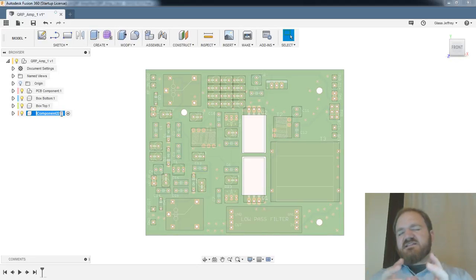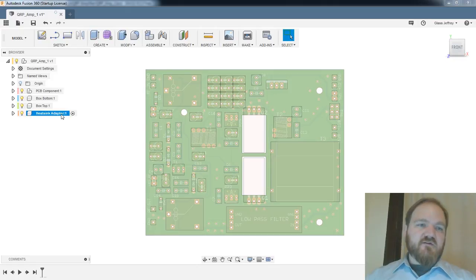And I think there is a non-zero chance we're going to need a third component that is going to be the interface layer between our box and the heatsink. Part of me is toying with the idea that the bottom of the box would have some kind of standardized mounting holes, and then you would print a mount that would basically be an adapter between the box itself and your heatsink. I don't know if that's going to be necessary, and obviously I'm still thinking through this design as we're drafting tonight, but let's make a component for it anyway.